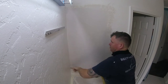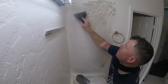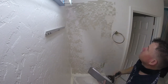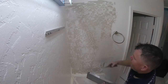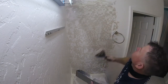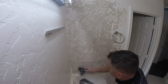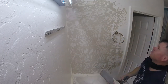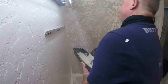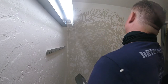Once the area is nice and perfect and looks ready to paint, now you're going to do a texture. This is a heavy skip trowel texture. Depending on your project, you might not have a skip trowel texture — but this is just matching what's here. If your texture is different, at least the first coat and second coat process is always the same for any drywall repair; the texturing is more of a finishing touch. I always want to take the texture further out and blend it in so it blends in nicely — that's why I'm taking this patch out a lot further than the original patch.